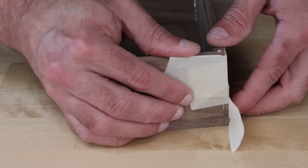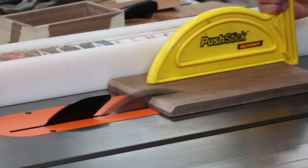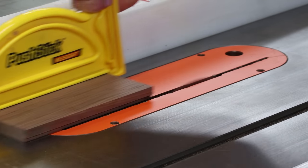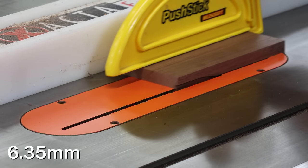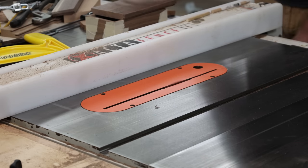If you're making a lot of these at one time, you'll use a lot of clamps — or you can do what I do, which is use masking tape or painter's tape. Make sure you squeeze all those joints really tight, tape it with a bunch of tape, and let it dry. While the glue is drying, we can start working on the lid. I like removable lids because hinges add cost and labor. I mill the board down to about a half inch thick and cut it to final size, about a quarter inch extra on all four sides.